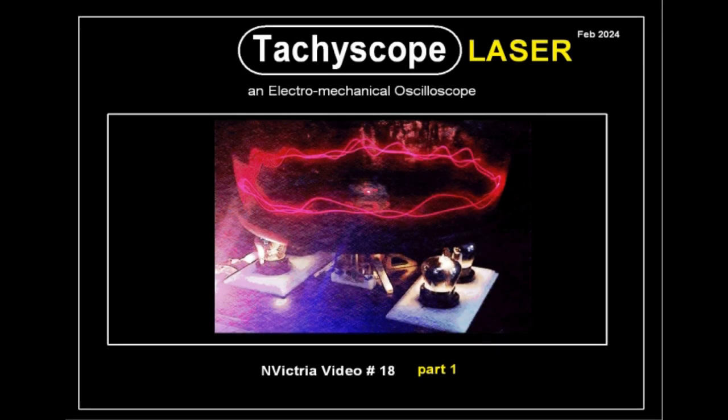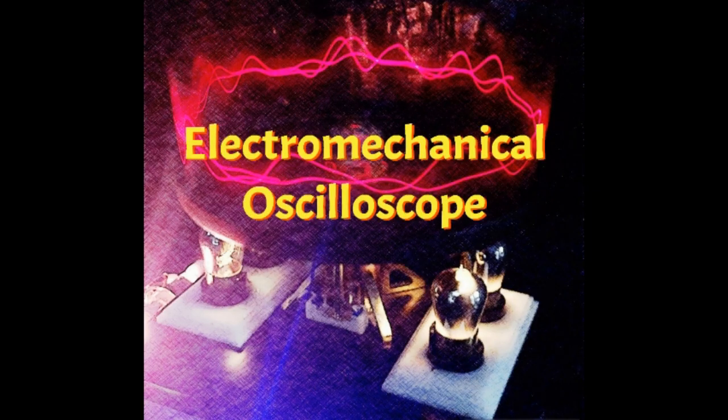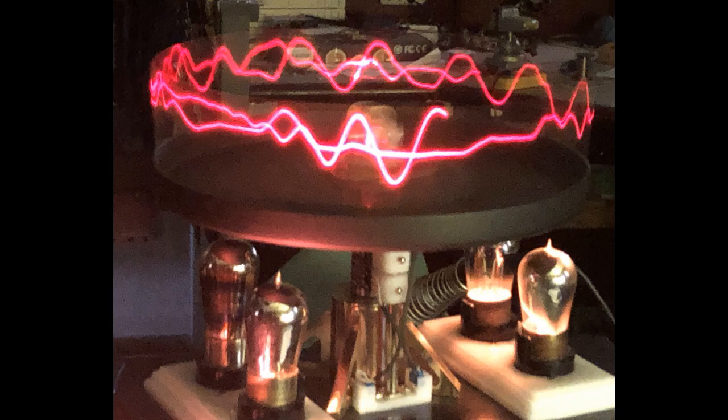This is the Tachyscope laser project. A 360-degree mechanical oscilloscope. Here you see a time-lapse image of an audio signal. The red lines are the result of a laser beam reflecting off a mirror attached to a moving coil, aka galvanometer, while spinning on a turntable.